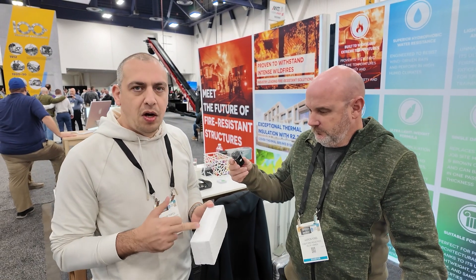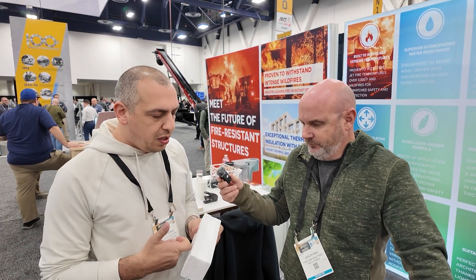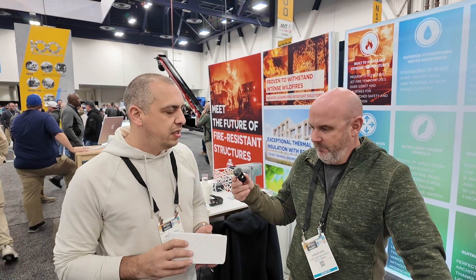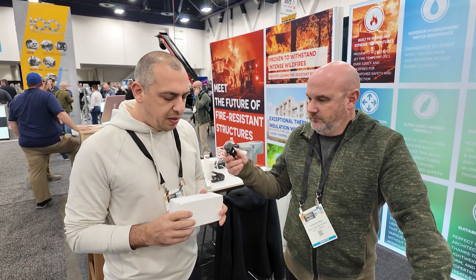You can go all the way up to one inch thick in a single pass. It's really lightweight and it builds out really fast — that's where it was really impressive. The product can be spray-applied or trowel-applied by pretty much any stucco contractor. There is no special training needed, no special tools needed. And because this product is super light, it doesn't put a lot of dead load on the structure, and it has some very unique insulation properties.